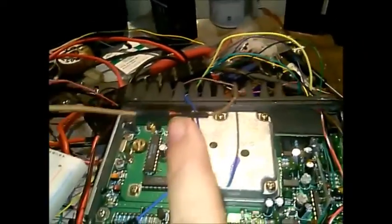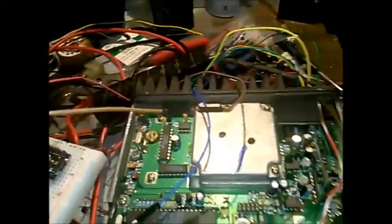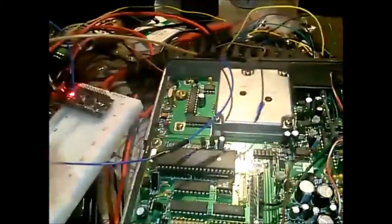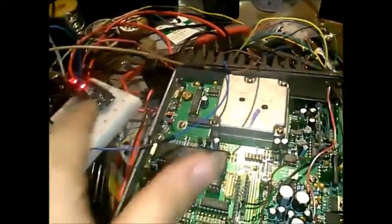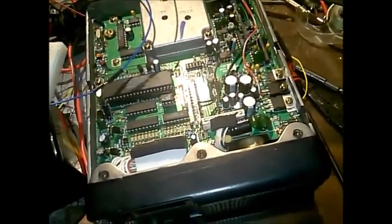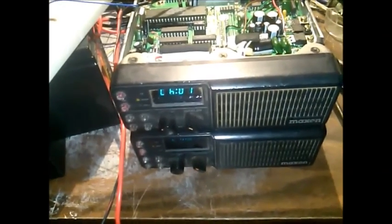This diode is important — it's on your COR line from the radio. If you don't have it, this thing will not bounce back to its normal state and will keep the transmitter keyed until it times out. So if you like it, thumb it up. In the description will be a link to the video — the guy wrote me the code and a link to the code is in his video. He's got a little demonstration where he presses the button and the LEDs come on. I added the transistor switch because it's needed for the actual push-to-talk function — most radios require you to shunt the push-to-talk to ground anyway. I'm Elf, ElfNet Designs, hope you liked the video — see you guys in the next one.